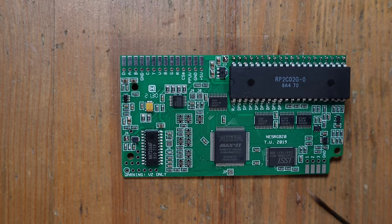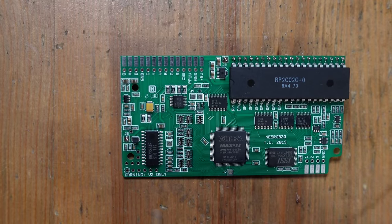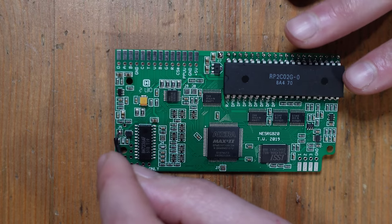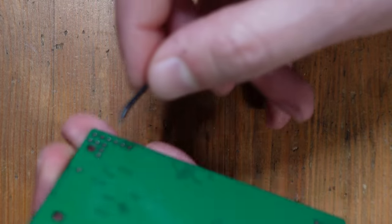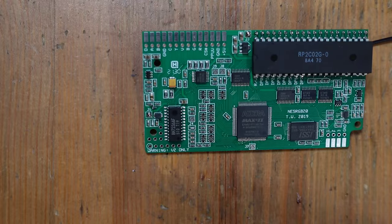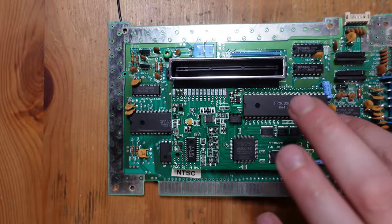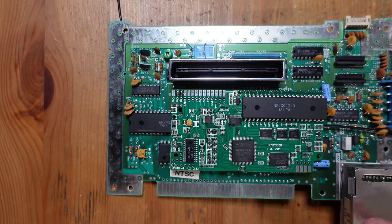To start with sound, we're going to solder a single wire to the NES RGB board for expansion audio. There's a tiny via right next to the J5 jumper we closed earlier. I'll take this wire — at least 12 inches long — slide it through and solder it in place. This is where expansion audio comes into the board and gets mixed in with the regular audio. I've now placed the NES RGB board into the socket, with the expansion audio cable running between the two ceramic capacitors and tucking into the underside of the board.